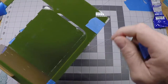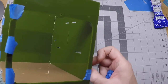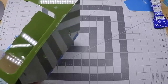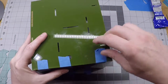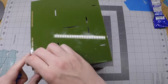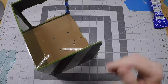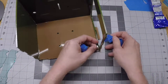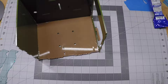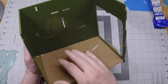Let's go around our crow box and remove any masking tape left over from previous steps. The masking tape I'm taking off right now is from the very first step when we cemented the box together. Once you start removing this you can get a sense for the actual strength of those cement joints - which is one of the reasons we chose it. Once the tape is off, we're going to run around inside the box with the glue gun and place hot glue on as many of these long joints as we can. That backs up our primary adhesive, helps with weather tightness keeping water out, and also helps reduce vibrations and general noise with the crow box - which is good when working with birds, since they startle easily.